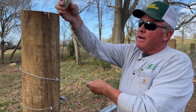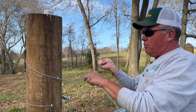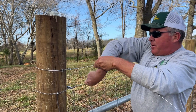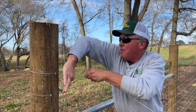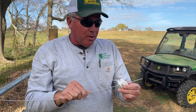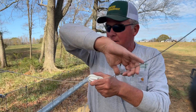Getting ready to rig this white corner insulator for our top wire. I'm going to tie what I like calling the New Zealand corner knot. Basically, this is under, over, back under — pull it out, slide it up close so that'll hold. Come back over and I'm going to twist it again, going around three or four times. Because at Pasture Management we're professional fence builders, we don't use pliers — snap that wire. A lot of folks think maybe I need to put this through the end, but don't rig it that way. Rig it so you're pulling across the middle of this insulator instead of tugging on each end.